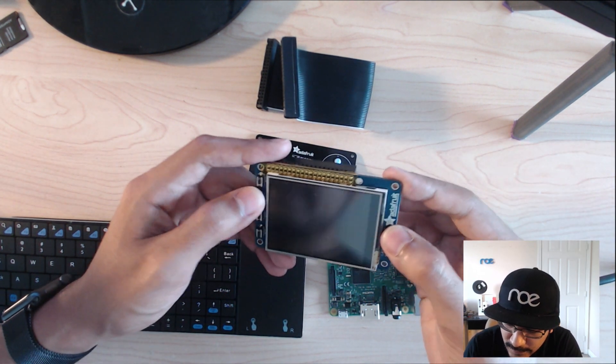The next thing I'm going to do is get the Adafruit Pi TFT helper — the Adafruit Pi TFT helper — which will be a lot faster. I'll paste it in and hit yes to continue. So the next thing we're going to do — the last part to set up the Pi TFT — is to use: sudo adafruit-pitft-helper -t. And then specify the type of display that we have. Be sure you type in the right one — in this case it is the 2.8 resistive.